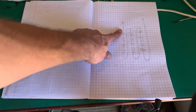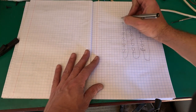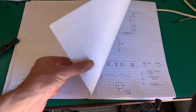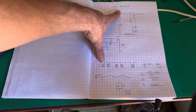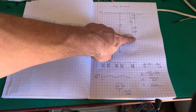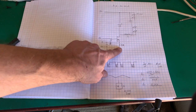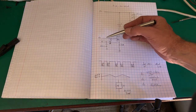Right, so we said we had our D plus voltage going out, goes through all our LEDs in series. And if we remember correctly, here we measured 224 volts DC, and here we measured 0 volts DC. Our circuit for this system is actually very simple. We have an input voltage, 220 volts in this case, through our LED string, smoothing capacitor, through an inductor that we saw, through the flyback diode, through the FET, through that big current sensing resistor. We have a resistor that goes off and another one.